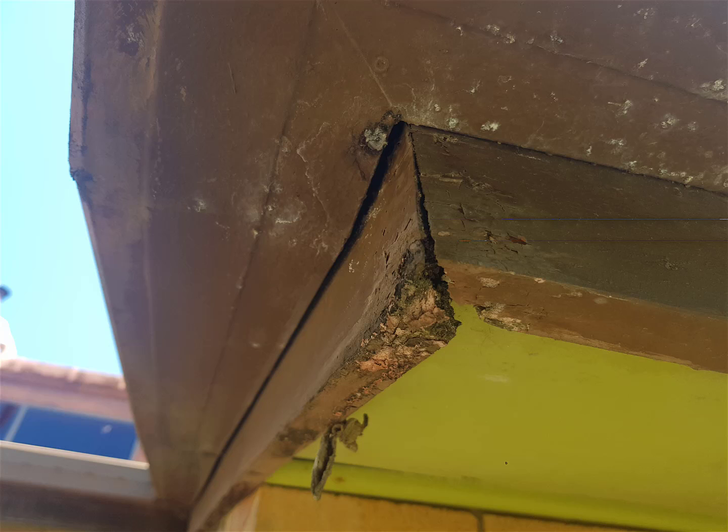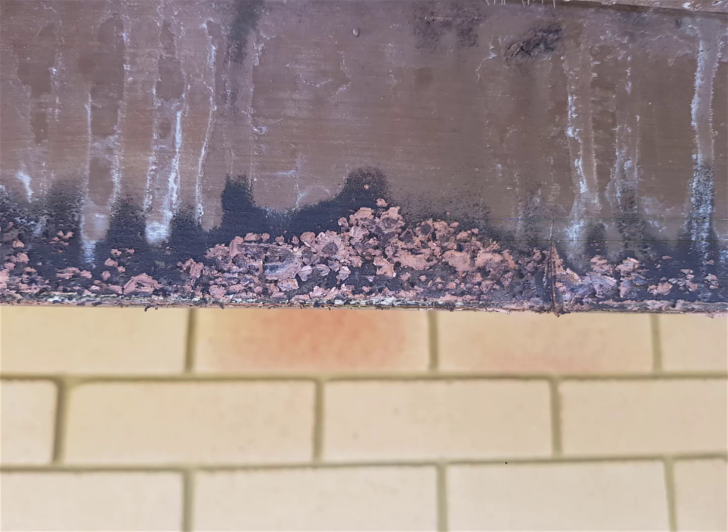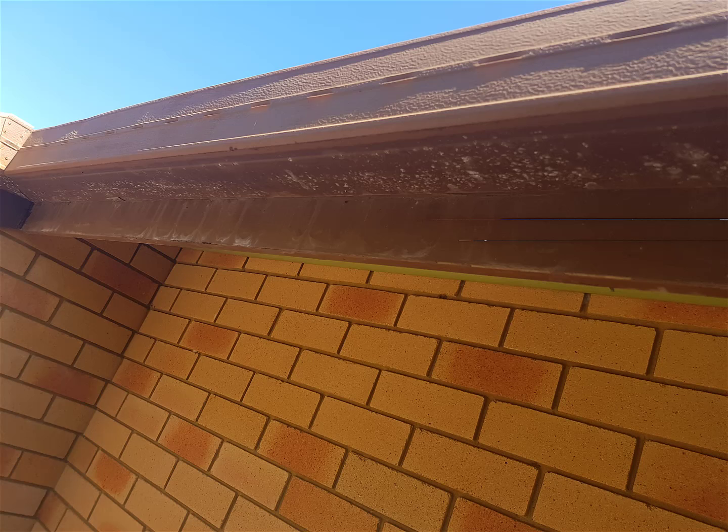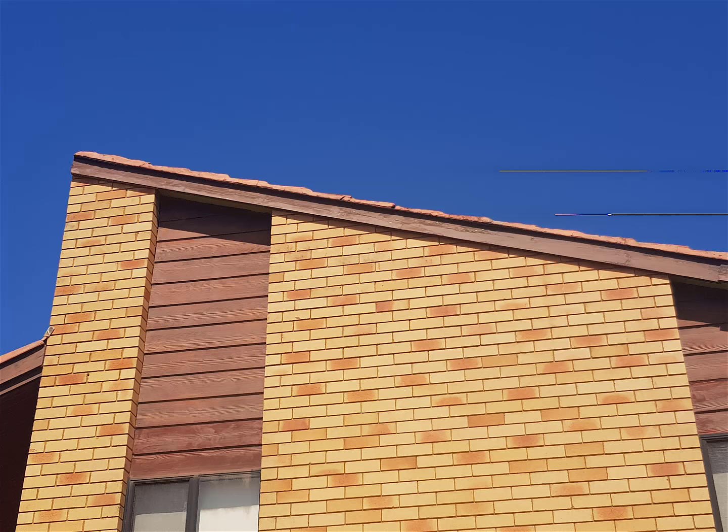More rotten timbers. More rotten timbers there. Some of those black spots, I want you to take note of this. You'll see the watermarks there on the fascia board. And we're going to note another picture in a minute. If you look closer, you can see more watermarks on the timbers. And they're coming down because the water's getting down behind the tiles. I'll talk about that. More of these white dots, which are corrosion.